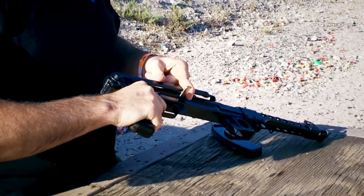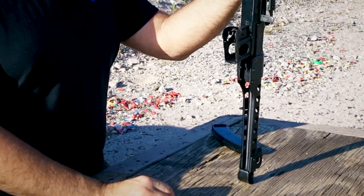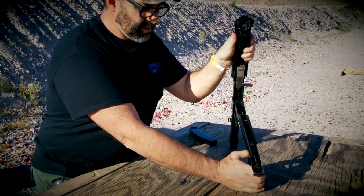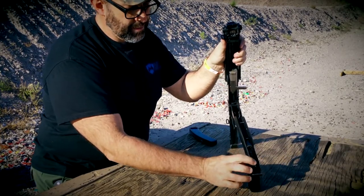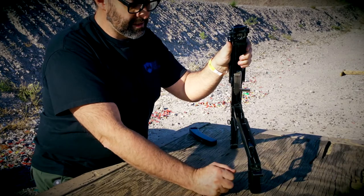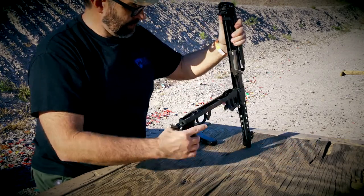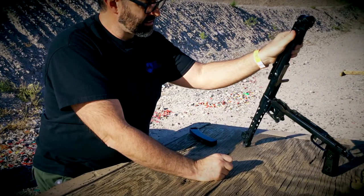Press it on fire, grab the charging handle, and bring it to the forward position. The Soviets were good about doing spring-assisted locks to shut the weapons and keep them shut. On the rear of the pistol grip here, press in on that and rotate down the lower — you can actually see how the sear is depressed when the trigger is pressed to the rear. The same springs that hold the top cover to the lower are the same op rod and recoil spring that's the spring for the sear. No wasted parts on this. How you figure out how complex a weapon is, is how many springs it has — less springs, less complicated, less going to go wrong. We're down to about four springs on this gun. When you press up or back on the safety, it just rotates that little slot and brings it up to block your bolt from going forward.